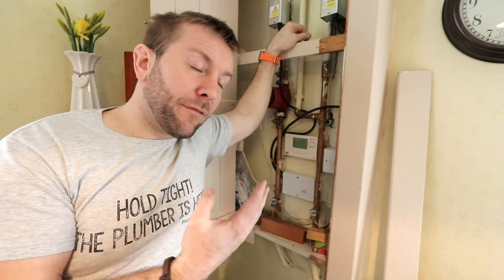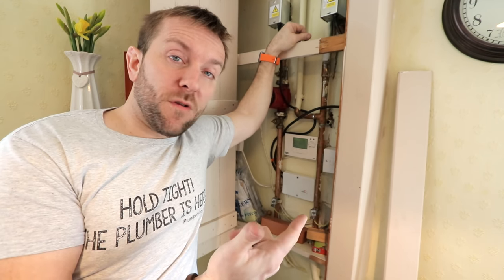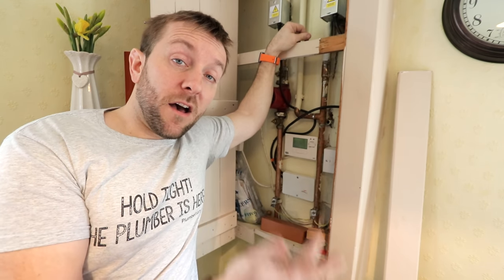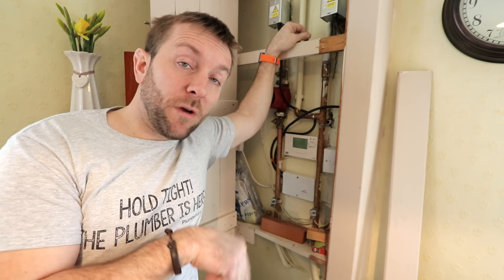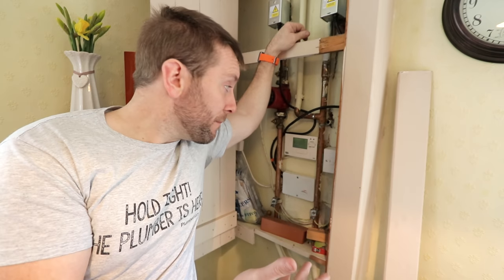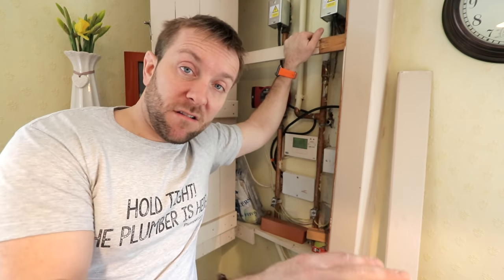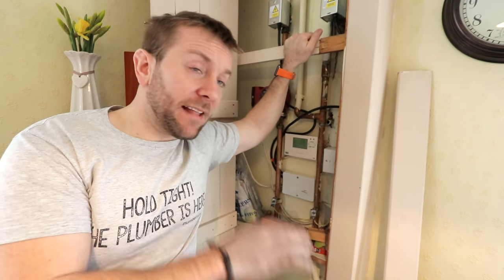You're going to look, there's 5 wires on one of these, actually 6. You've cut the white one off. You know the blue one goes to neutral. You know that the green and yellow goes to earth. And then all you've got to worry about then is a live signal and then your switch feed in and out. So it's fairly simple once you've got your head around it. But when you take one of these off, it's like spaghetti junction, isn't it? So it's sort of getting that in your head.